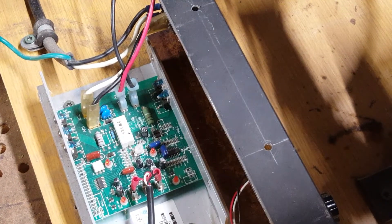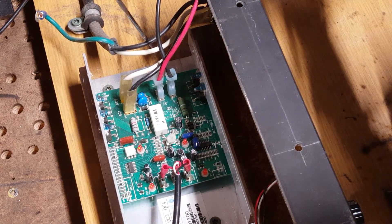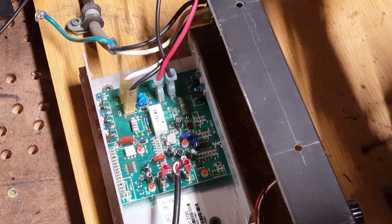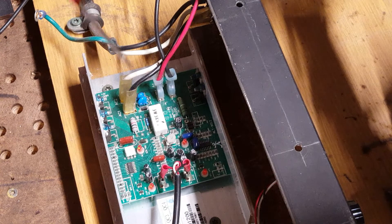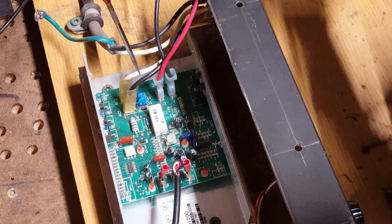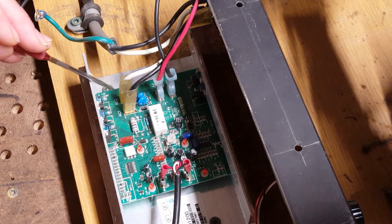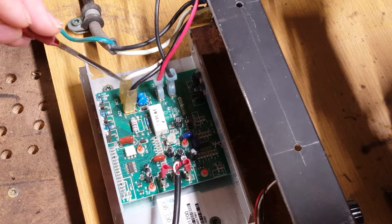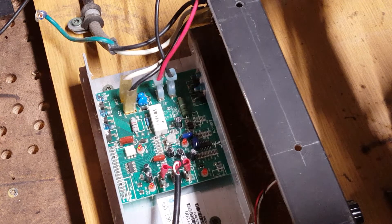Zoom in a little bit. We have power coming in — mains 110 — and there's a switch up here bringing the power in, simple on and off, dropping into AC2 and AC1. If your motor has a thermal brake, two blue wires, you can wire those between these two terminals — you'll have blue written on the case and white on the other — and you can put the thermal brake across there for if the motor gets too warm.